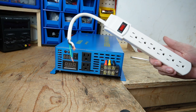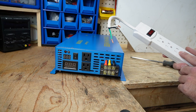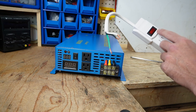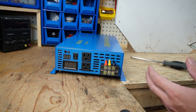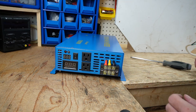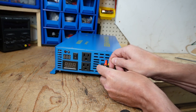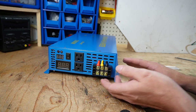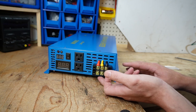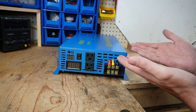I'm going to hook up this power bar and power everything through the terminal block. This power bar has a 15 amp breaker built in, so I'm going to be protected on this side. If you are wiring this up in your RV or trailer, you may want to use some sort of a load center or panel in order to control the amount of power for the gauge wire you're going to be using. If I remove this terminal block cover, you're going to want to wire this part up before you actually mount your inverter, because you have to get the wires up into the bottom and it's going to be a little bit difficult if it's mounted on the wall, floor, or up underneath your cabinet.